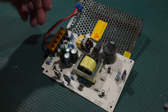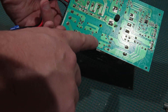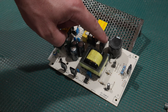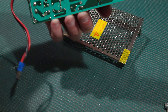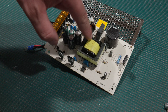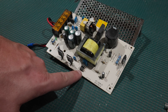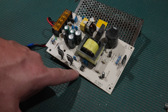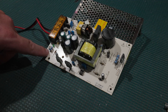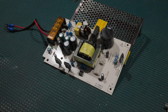Input is actually here. We have a bit of isolation, with slots cut in so primary would be on this side. Switching regulator, or switching filters. Bulk filter. This is probably the switching element; it drives that transformer. We have output filters — these are probably regulators. Photo-optic feedback to control the switching for regulation. And here is the output regulator adjustment. Very, very simple power supply; pretty easy to work on. Don't even need a schematic.